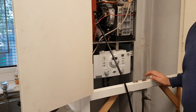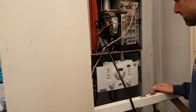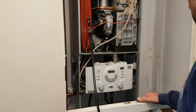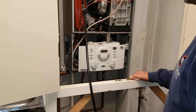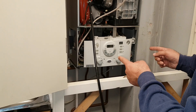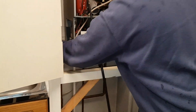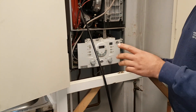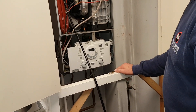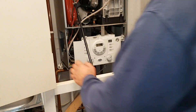I'm going to ask you some questions. Where are we located at the moment? First floor — okay. So we're going to drain the boiler so we can do the expansion vessel. Are we going to close the isolation valves? Well, there's no pipes going up, the floor pipe is going down — so most probably there isn't an upstairs, no radiators upstairs. That means the boiler is at its highest point, higher than the radiators, so we don't really need to close them. That's how you check out the system and analyze what's going on.